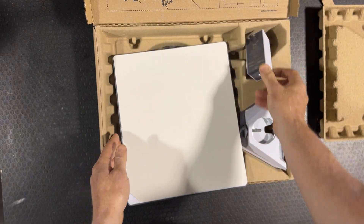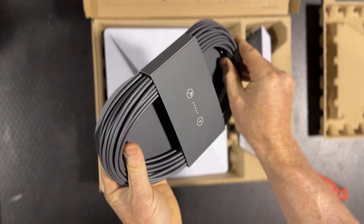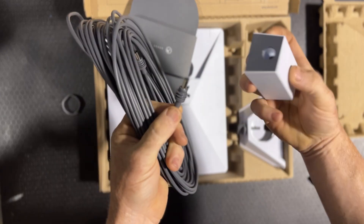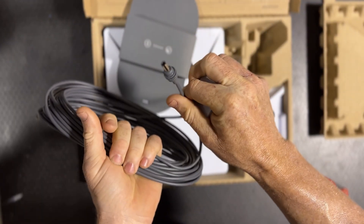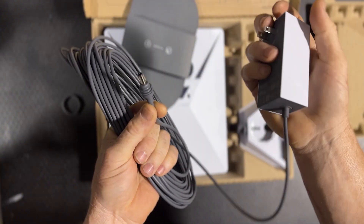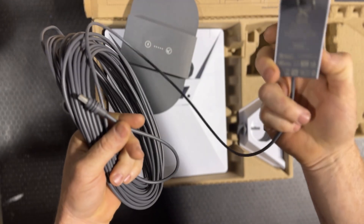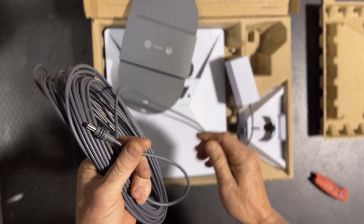For us we're obviously thinking about 12 and 24 volts. This is the power cable that is designed to power the Mini — it's about 50 feet long and it's got this barrel-type DC jack. You're plugging this barrel-type DC jack into the 120 volt power brick, which powers the Mini. This is going to be DC — 12 volts or 24 volts. It'll probably output around 24 volts because one of the problems with this long cable is voltage drop in the line. Starting at the power brick at say 30 volts, by the time it reaches the Mini it will still be high enough voltage to power it.